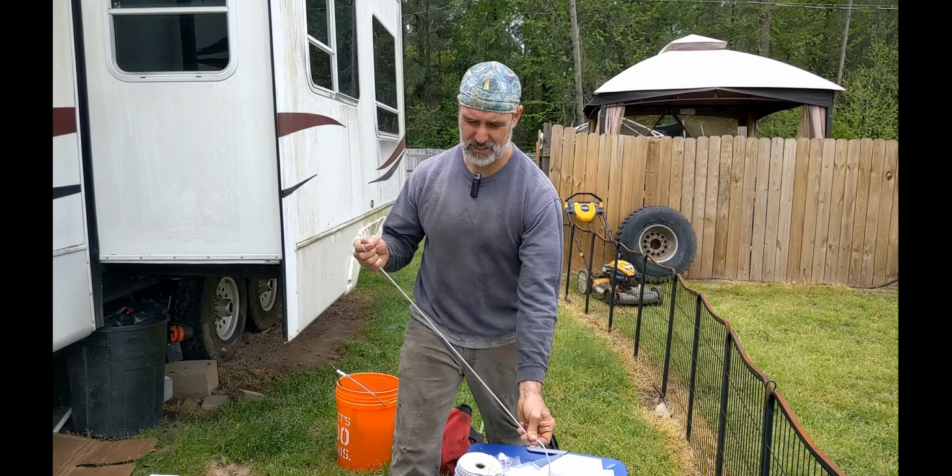With the pipes or posts cut, the next step is to fashion our lids and to kind of relief the tubes so that they don't interfere with the bungee. And at the same time, we'll be setting the bungee or shock cord up on these lids also. So the shock cord runs in a hole here, out a hole there, and then so that it doesn't hang up and interfere with closure, we have a slot on both sides. And of course we have to mount our knob.